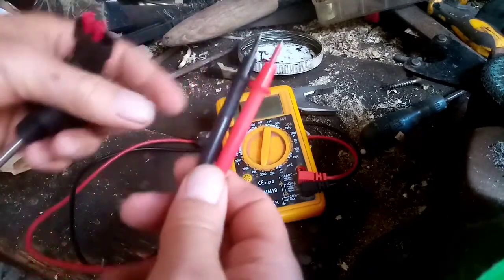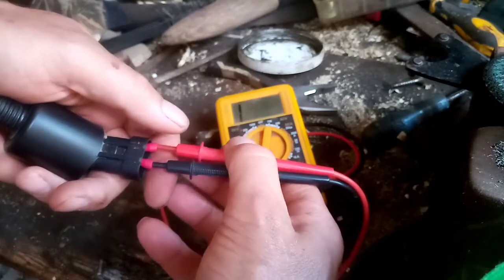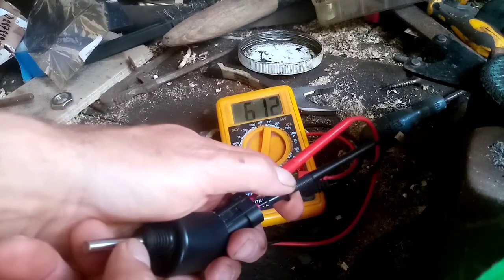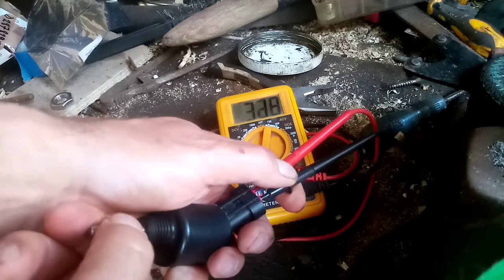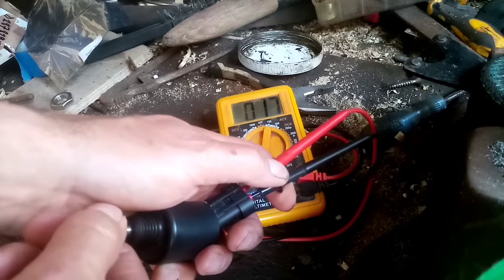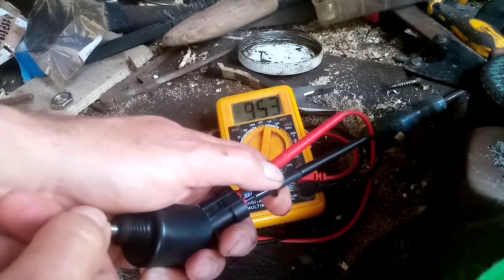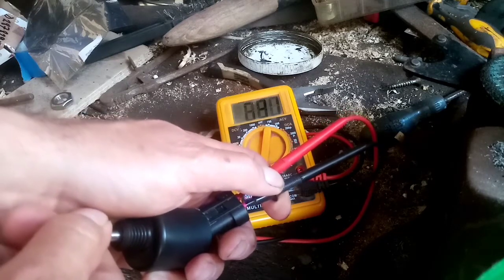Once you push these in, you've got a reading. It's got to go smoothly - as you can see it's counting down. In the instruction book it's telling you to set it at 500, which is where the combine reads two volts. As you're swinging it around to get to 500, it all seems to be working quite nicely.